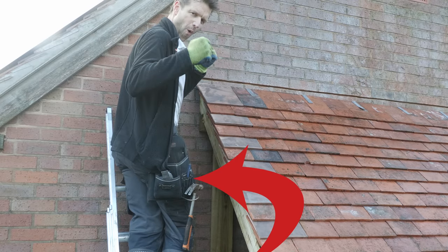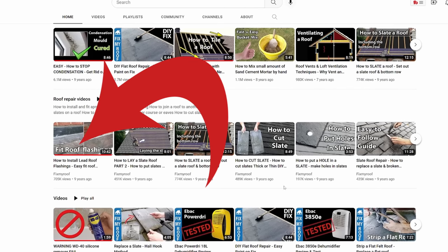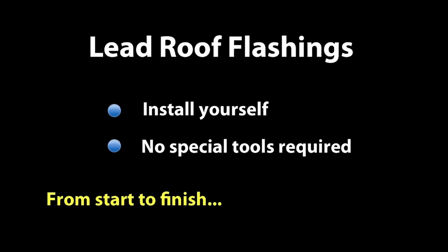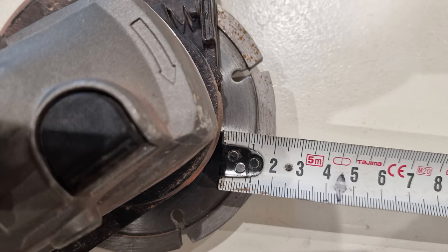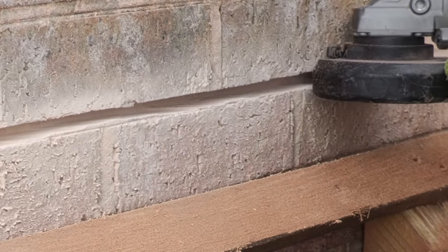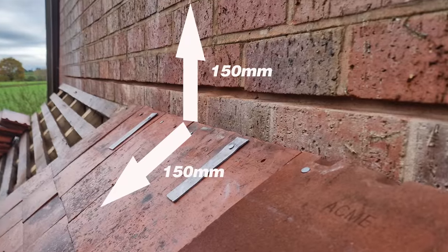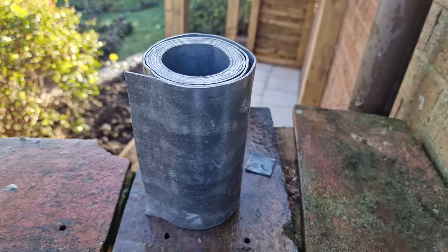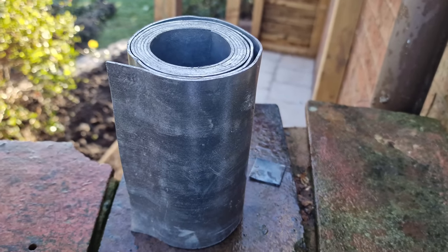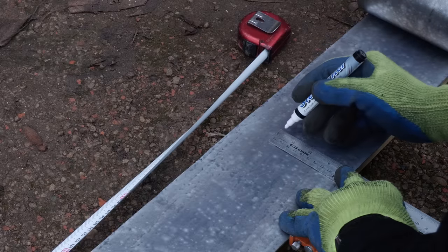Get yourself a tool belt if you're doing any roofing - it's essential. And so I was on to the lead flashing - special thanks to the Fix My Roof YouTube channel for some crucial tips. My mortar raking disc only clears the grinder by 20mm, which was the depth I raked out - it's recommended to excavate 25mm but 20mm was more than adequate for the lead fixing clips. The recommended 150mm overlaps are standard but I used less - it's only a log store, and I spent £60 on a 6-metre, 150mm-wide code 4 lead roll. Code 4 lead is the minimum recommended by the roofing company for flashings like this.